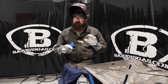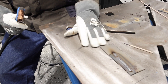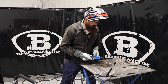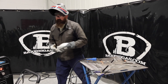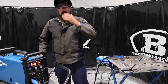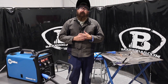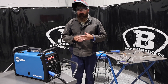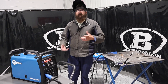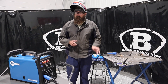Very crisp, short arc — and we're only on 110 volts. That's pretty impressive. Nice little machine. I was going a little slow but it's not bad at all — it welds really nice with a real crisp arc. Impressive for just a 110 unit running .030 wire on eighth inch material. For anyone in their shop doing auto body work, these little machines are perfect — putting in panels, bike work, anything like that. Where they lack is if you have 220 power and want to use it — then step up to a bigger machine. But for entry level, and you can add a spool gun for aluminum work, it's awesome.